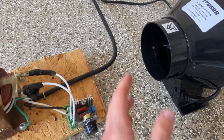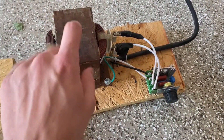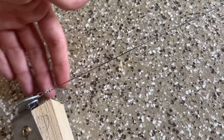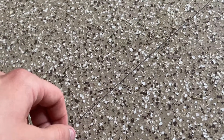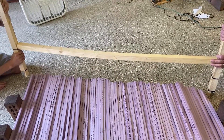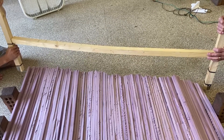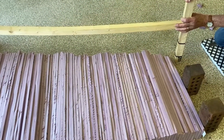With the addition of a fan blowing air onto the heat sink, it doesn't get quite as hot, and it also keeps the transformer from getting too hot. Another improvement was replacing the wire with a much thinner one, which allows it to get significantly hotter so I don't need full power to reach proper cutting heat anymore. With those improvements made to the hot wire cutter, I was able to stack up a large number of individual foam pieces left over from another project to test the cutter and the templates.